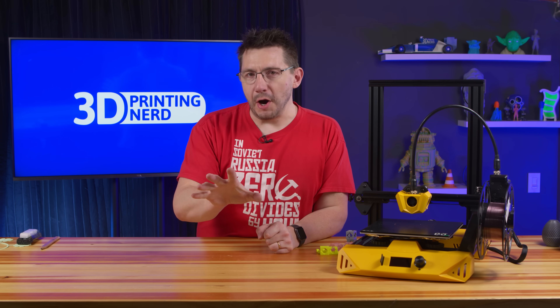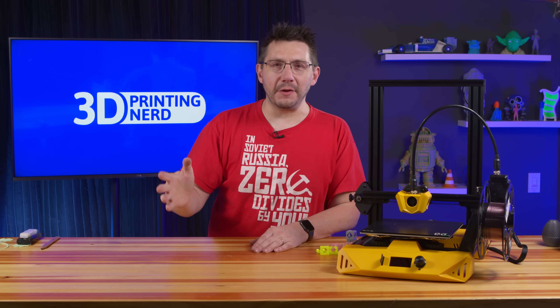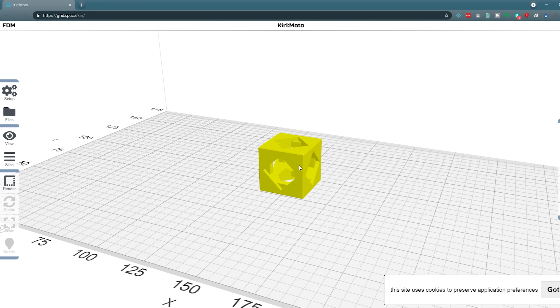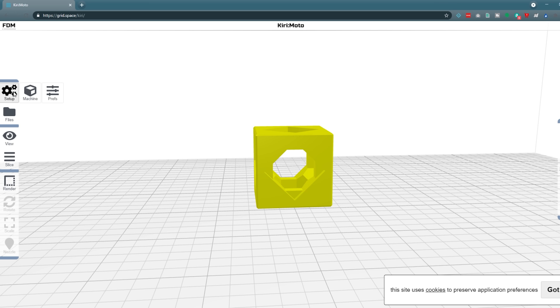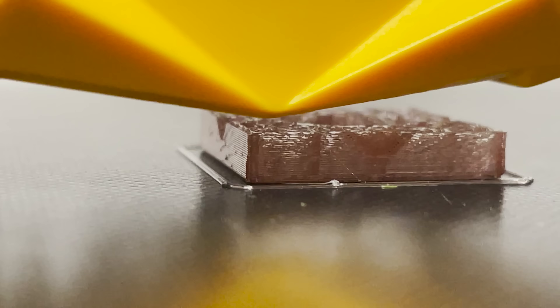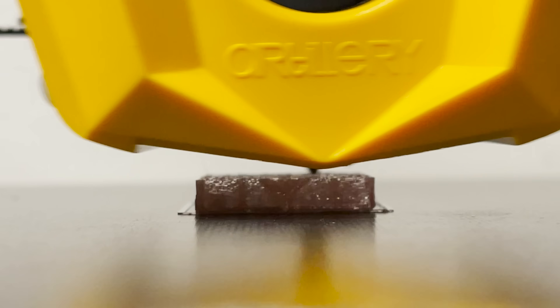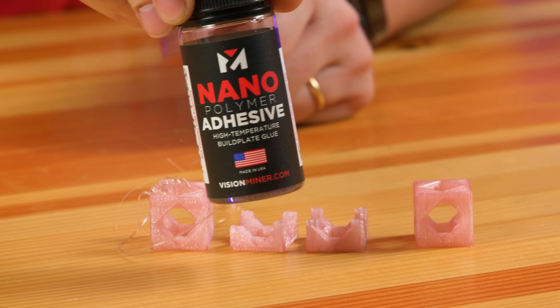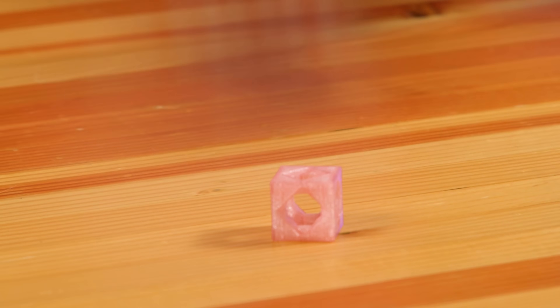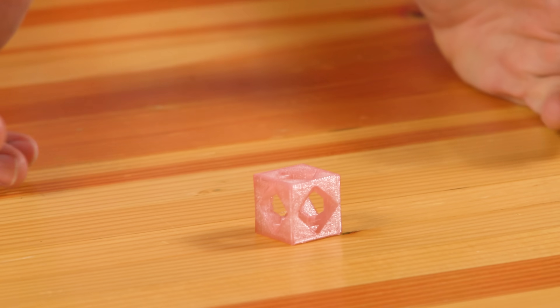Finally in the printing department: Kiri:Moto from Gridspace. It is a wonderful slicer — I just found out about it. It's a slicer that runs in a browser but not in the cloud; it runs locally on your machine. It's open source, 100% free, lightweight, easy to use. I'll put a link in the description — go use it. Through Kiri:Moto I tried PETG. I had some issues with bed adhesion — it wasn't until I used Vision Miner's nanopolymer adhesive that it actually worked. Some broke free, but one completed and looks good in Greengate's PETG.